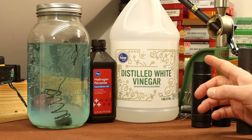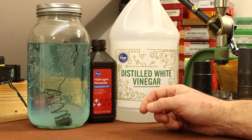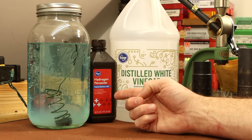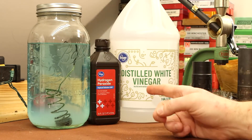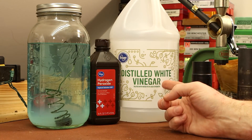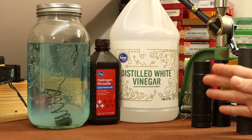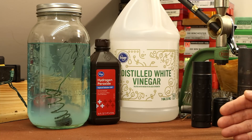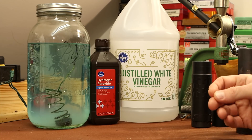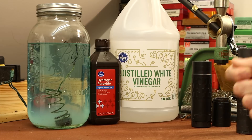It's a 50/50 mixture of hydrogen peroxide and distilled vinegar — your standard strengths. Three percent hydrogen peroxide and vinegar with a five percent acid strength. That mixture is very good at dissolving lead, but the problem is that it creates lead acetate. And lead acetate is awful — terrible stuff. Water soluble, extremely bioavailable. Soak-through-your-skin sort of terrible.